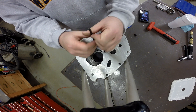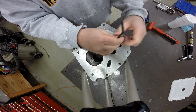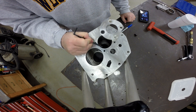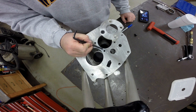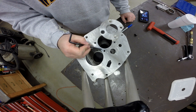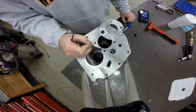What we're going to do is weld that hole back up and get it in the correct location. But as an added bonus, we've got a crack from here to here between these two bores. Normally I would just take a carbide burr and grind these things out, go back and weld them up. But since we've got these two repairs so close together, we're going to go to the milling machine.